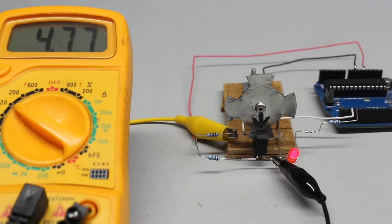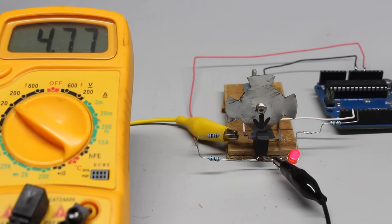With a toothed metal disc, a microcontroller can detect rotational movement. The terminal marked with the plus at the phototransistor has to be connected to an input pin of the Arduino; minus of the sensor unit must be connected to the ground pin. The sensor disc has 4 teeth. In the initial state a tooth blocks the infrared light, so plus 5V can be detected at the input pin of the Arduino — a high signal. With an additional pin switched to output mode connected to a resistor-LED combination, the Arduino displays the high signal and the LED lights up.